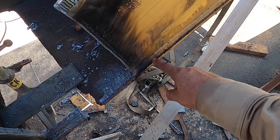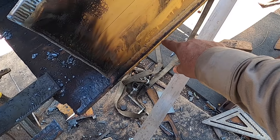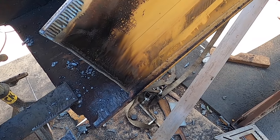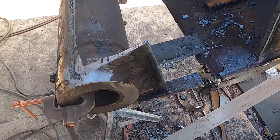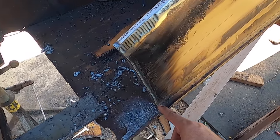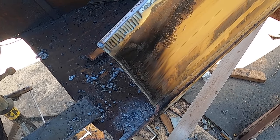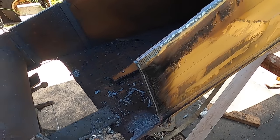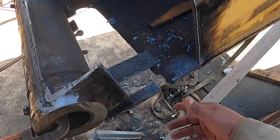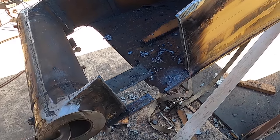I think I'm gonna go about 4 inches or so past this weld joint before I cut this other piece, and then go straight across. Same thing over here, and that way there's not too many weld joints in one spot. Offset it about that far. Fortunately, this top one is offset by over a foot, which is good. And so at least the bottom will have the same, so not so much stress is built up in just one area. All right, it's looking good.